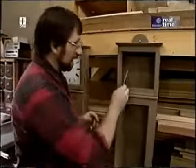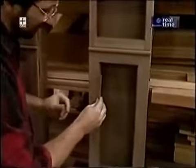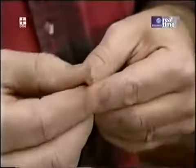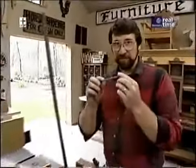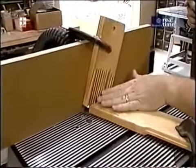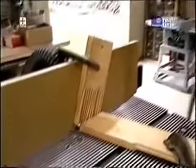To hold the glass and wooden panels into these rabbets, I need a little molding — it's a quarter-inch quarter round, rounded over and square on the back. Obviously you can't mill a piece of stock this small, so I've set up my router table with a quarter-inch rounding-over bit and a couple of feather boards to hold the stock in place.